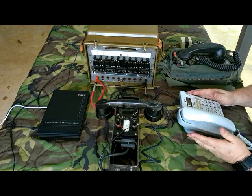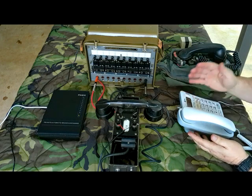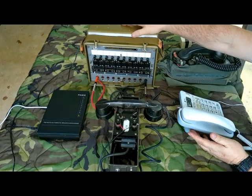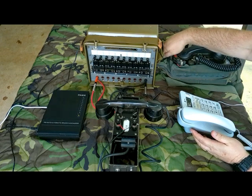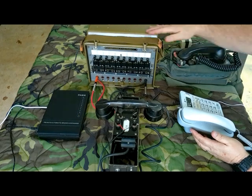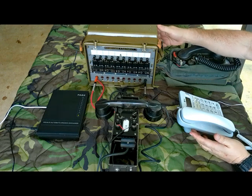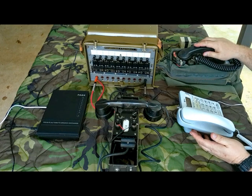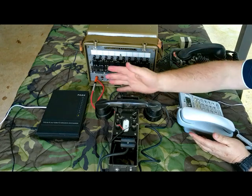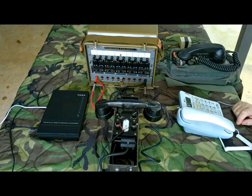Here's basically the setup we're going to use today. I don't have a Polish LP-10 phone switchboard, so what I have is a Soviet P-193, which is the same switchboard except it's got a generator in it and a handset on it. I'm basically not going to use the generator — I took the handset off and I actually have this TA-312 connected to the operator position. It's got operator binding posts just like the LP-10 does, so the TA-312 is my operator phone. I also hooked up a Swedish M37 phone to be my subscriber to make phone calls with, just because it was handy to grab.